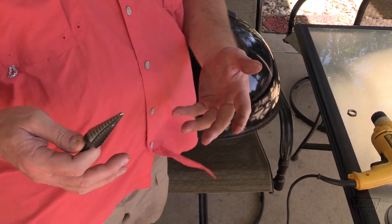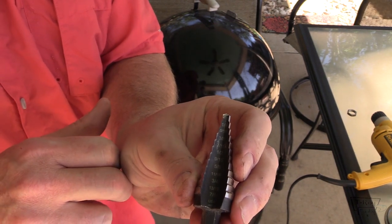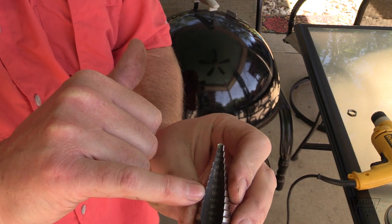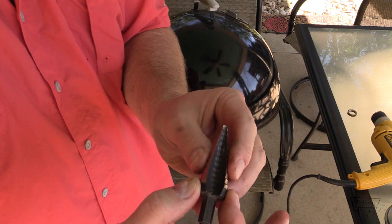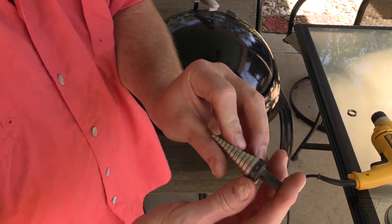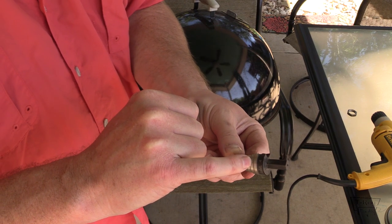But you get some instructions that come with the thermometer to tell you how big of a hole it needs. And I don't know if you can see in here, but if you look in the dark area here, it actually has incremental readings. Down here it starts, I don't know, maybe a quarter inch or something, and it gradually tapers up as this gets bigger and bigger, all the way to 1 inch at the widest portion here. And the 13/16 reading on this gauge, so like a half inch, 1 inch, quarter inch, it's all in there. But if you look at these different stainless steel cutters here, 13/16 is this second to last one. So I don't need to go to this last one. I just need to go to the second to last one.